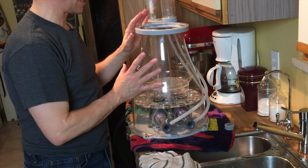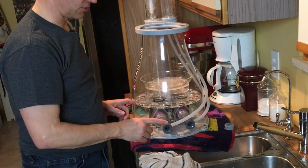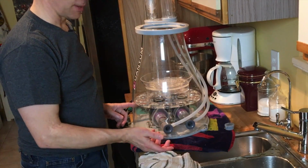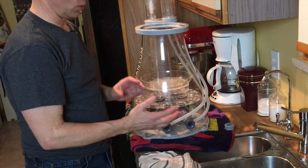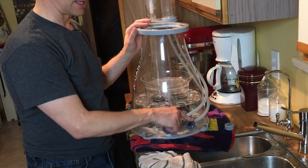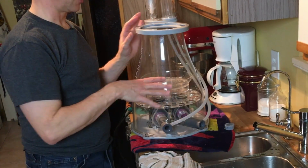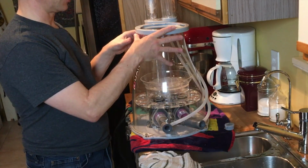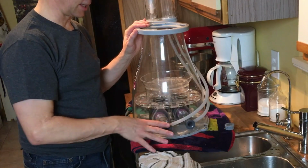But when the power goes out, the back pressure of the water pumping out of the body through these two can knock one of them out. And what's been happening, I don't know if I reversed these by any chance, and if the one's slightly different than the other, this is the one that kept coming out. So this one would tilt out like that, and if I saw the skimmer body running around this height instead of being full of bubbles, I'd have to reach into the water of the sump, and I'd have to get that back into place and get it going.